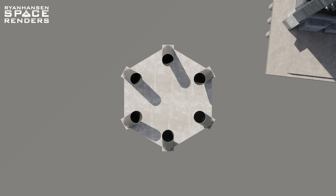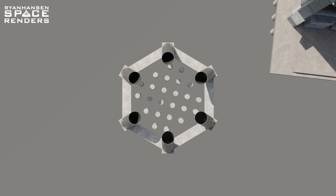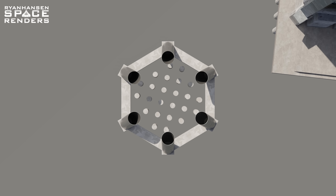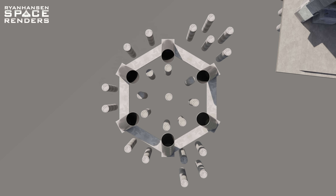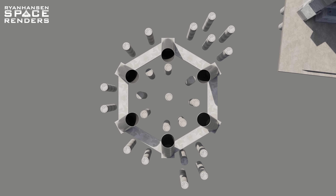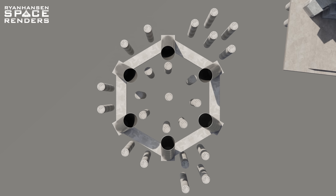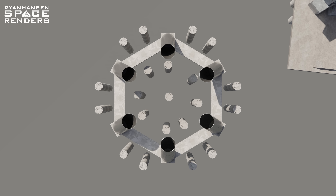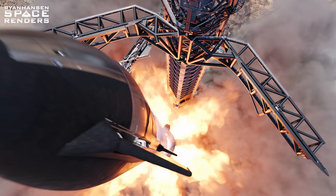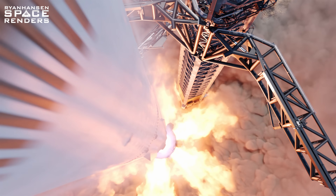These are also used to provide support for the direct blast surface. The original design featured 24 auger pilings instead of 9; however, these are a larger diameter and likely much deeper as well. There are 15 more of these RBP pilings installed outside of the original tension band of the foundation. The placement of these piles creates a bit of an odd pattern. In general, we would expect it to be somewhat symmetrical, considering there is an equal amount of high-pressure exhaust gases escaping in all 6 directions coming from under the orbital launch mount.